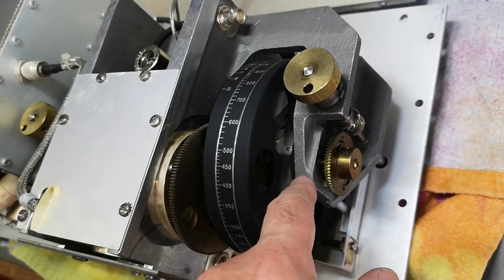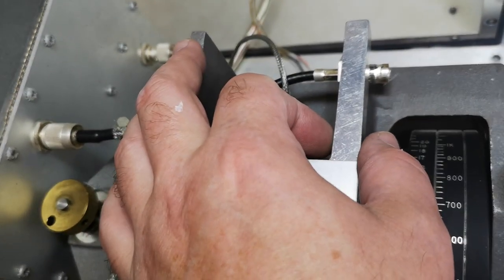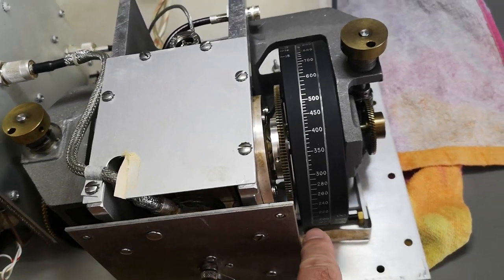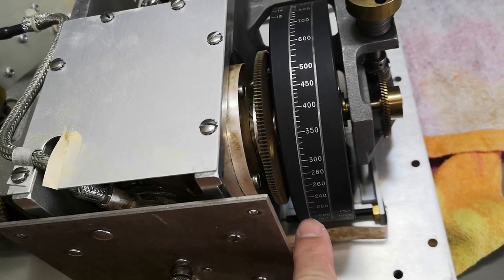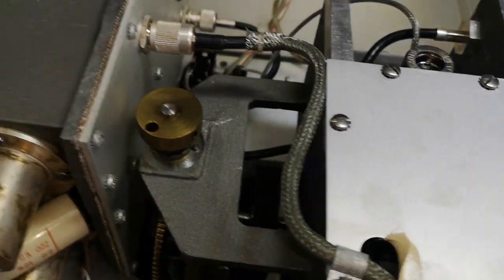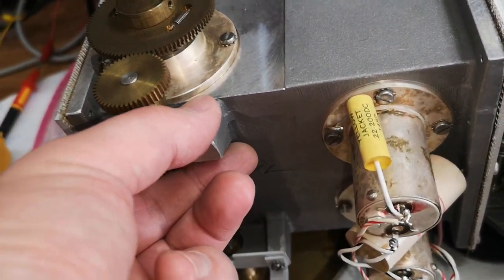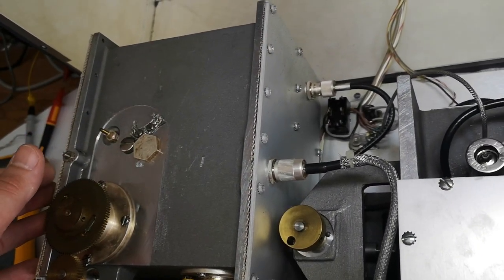Look at the mechanics — everything is made as thick and as massive as possible. The reason for this is to have accurate, stable, reliable measurements because nothing is moving or bending. Remember, this unit is 60-something years old and it still hits the line within half a line width when I compare what this unit reads to the real thing. When it comes to frequencies, it's just insanely accurate. Even the dual-cased oscillator section — everything is just this thick and this massive. I'm really looking forward to opening that unit to show all the cool details.